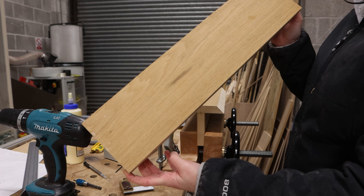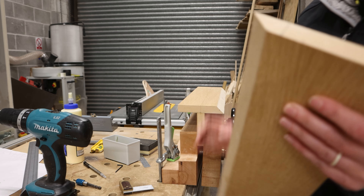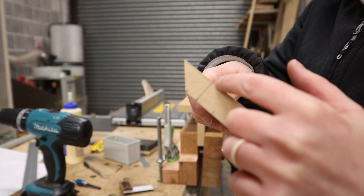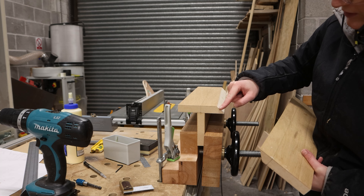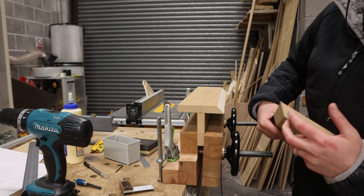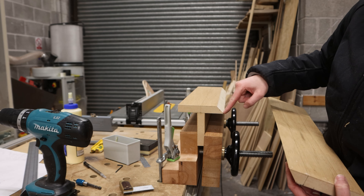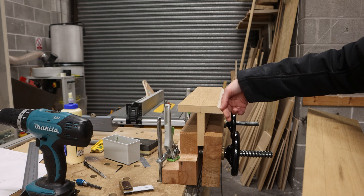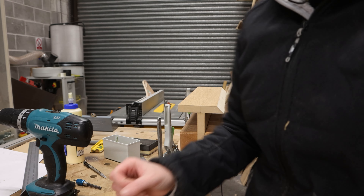I just marked up my fence exactly the same way as we did this one. One thing to note is that I made sure that this line crosses at the meatiest point within reason, not going too close to the edge, and obviously trying to stay as center as I can. But if you went dead center you'd only be going through minimal material, so I'm trying to get it where it goes a little bit higher and through. We'll countersink these holes.